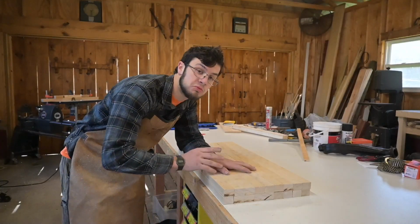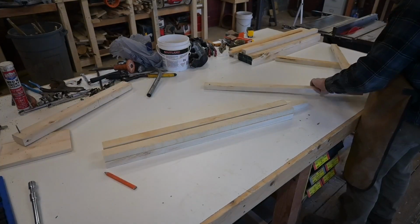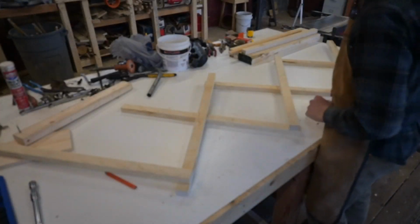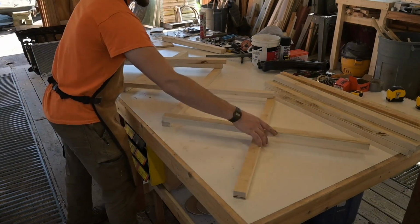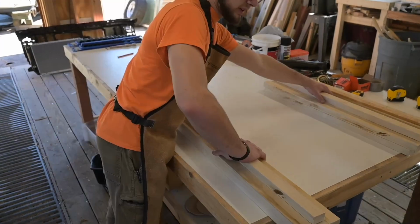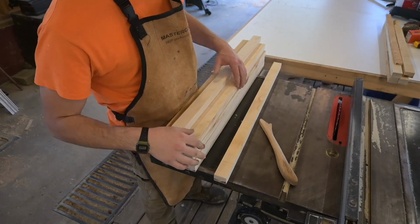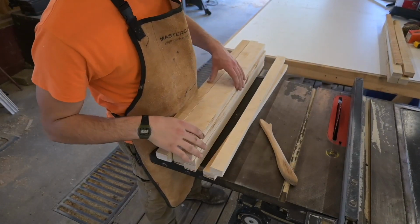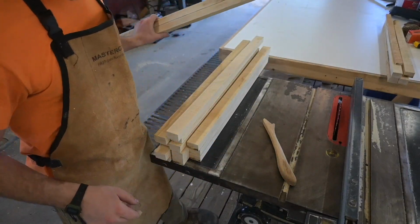Now this looks like way too much wood, but you have to remember that it is. This is 18 pieces. I only need 14. We've got one here and there, and this one will be split in half. That is roughly what it will look like. Okay, let's start planing. Get these things down to the right thickness. Once we get the length right, then we can also do the hole drilling. We're gonna check for straightness, because you don't want it to be too crazy off. Pretty good, mostly. Joint these two straighter, and then we're gonna plane them, and they'll be fine.